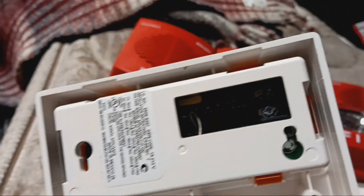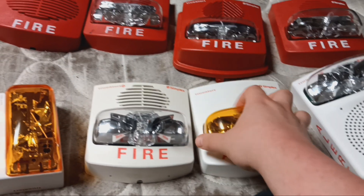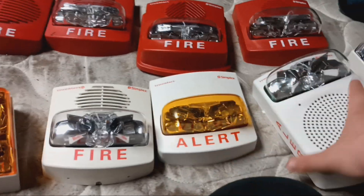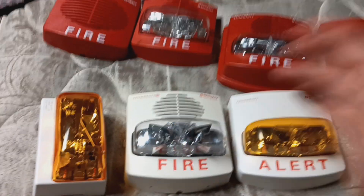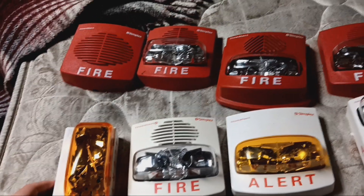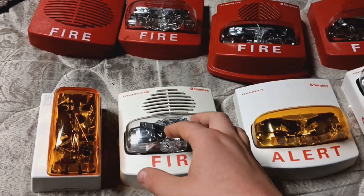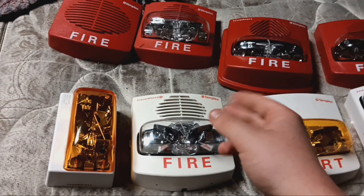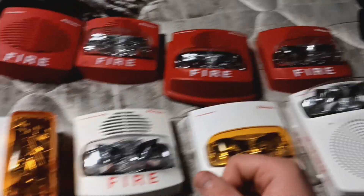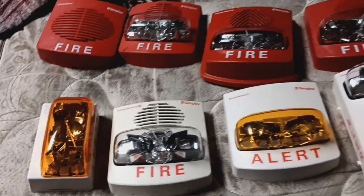Here's a look at the 4906-9207 — you've got the dip switches. I'm not going to take the covers off of these because they're a pain to do. On the original True Alert strobes, the address switches are on the bottom somewhere, whereas on the True Alert ES they're on the back. The reason I said they do way worse is because, thanks to the addressable versus conventional philosophy, these cannot work conventionally. When you apply just straight-up 24 volts DC power, they will not work — even SmartSync won't do it.